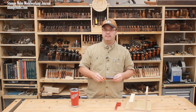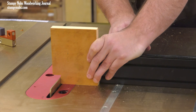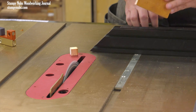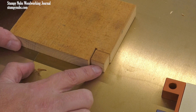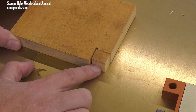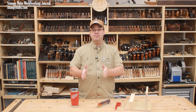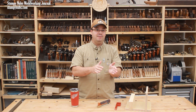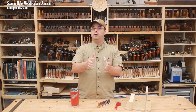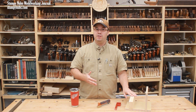So let's start with the blade's thickness. The most precise way to set that is to cut the corner off a scrap of wood. If you put the cutoff back in place, you can see how some wood is missing from the saw's kerf — we turned it into sawdust. That's what I want to measure: the missing sawdust, because only that will account for the blade's thickness, any minor differences in any of the teeth, any run out in the arbor, or anything in the table saw.